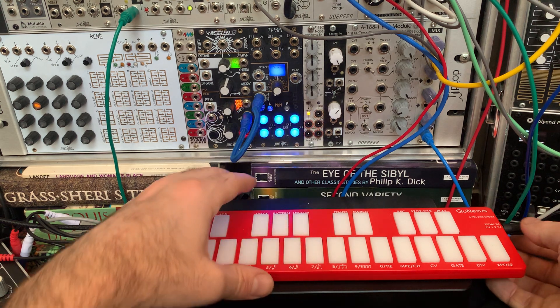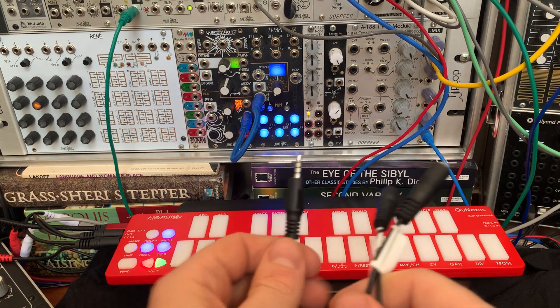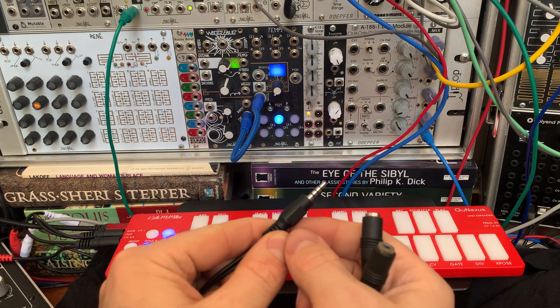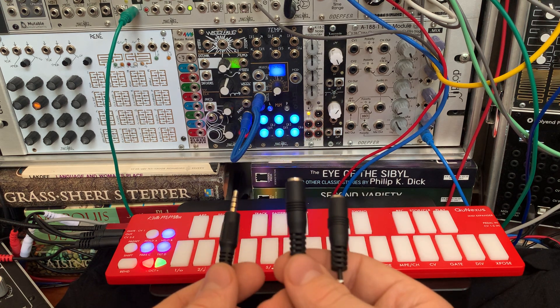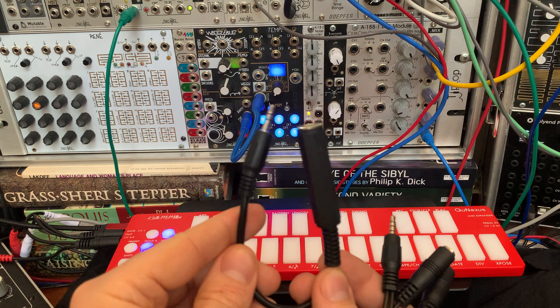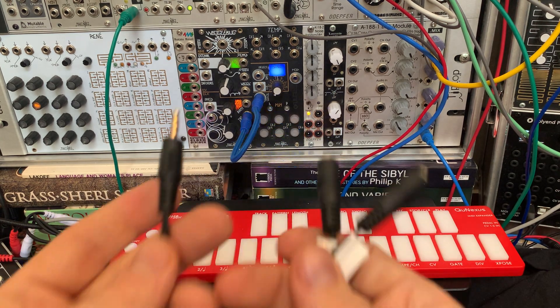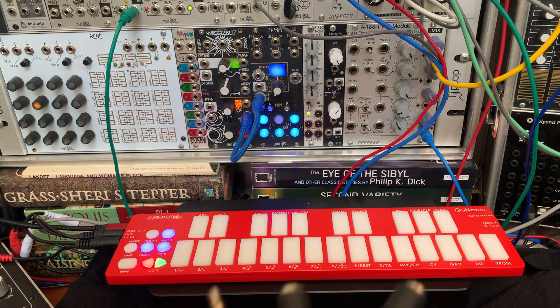A couple of gotchas on this. First, you have to use our cable. We have one input jack on the right here. It is a TRRS connector, and this is just a holdover from the original 2012 design. This one jack can be used with two CV inputs or with an expression pedal, but because of that we have to put five volts on one of the rings, which means this is a custom cable. You can get this cable and the other adapters in our CV cable kit or QNexus cable kit, available on our website or through one of our dealers.